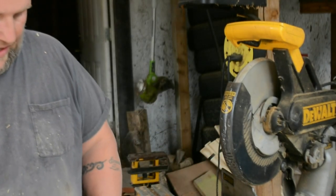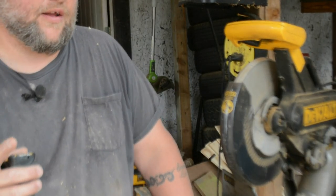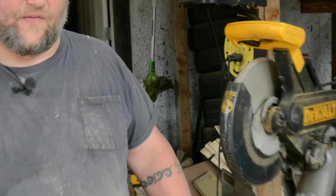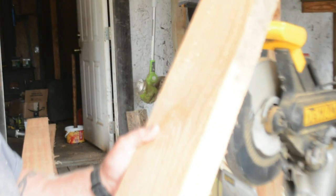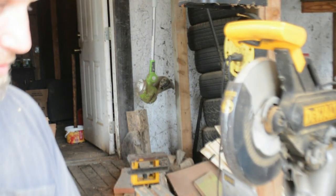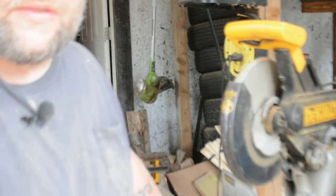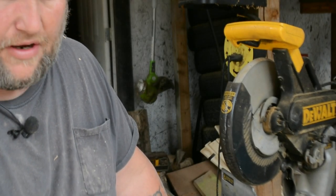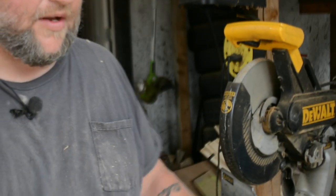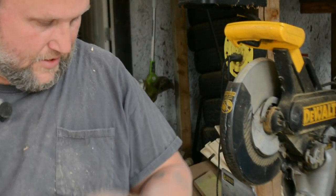In addition to that, I will need 4 feet, because I put a 2x6 foot on the bottom of my tables. Gives it a little bit bigger of a footprint, so it won't sink in the ground, but that's also what typically rots. So that's kind of a sacrificial piece, so you don't have to replace the whole leg, just that piece. So I'll need four of those.